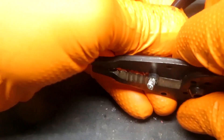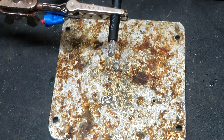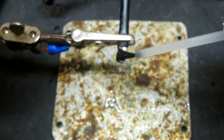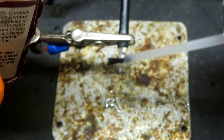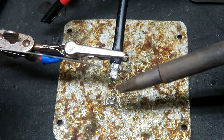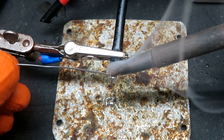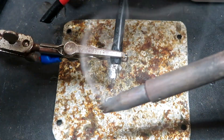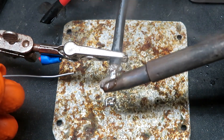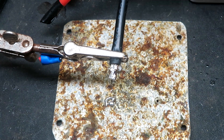We're just going to strip off a little bit of extra material. We'll get some more tin on this thing. Don't forget to always clean off on the sponge. We'll move this up a little bit more — there we go, so we have more leverage. Now we're going to add some liquid flux and we're just going to tin it up some more. You don't have to get fancy, just enough to tin it. Just put your iron on there and the solder will just stick to the wire like glue. You don't need a lot of heat, just enough. Try to get all the way around the wire as much as you can. Whatever you get on the iron, just clean it off.